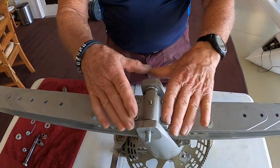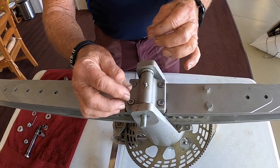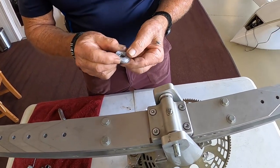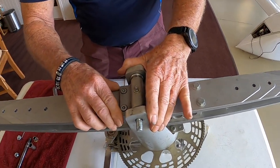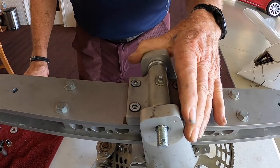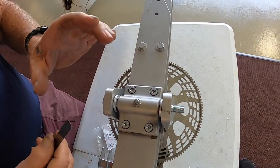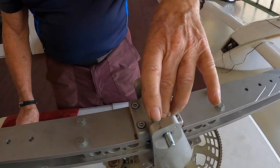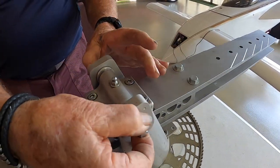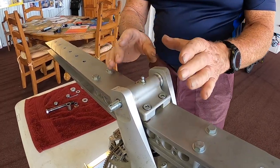Now that we've assembled the hub bar to the teeter tower and chosen a couple of spacers — each spacer should be identical in thickness. When you order them from Autogyro, they come in pairs etched with their thickness. If you've flown for a hundred or two hundred hours and notice slop, use a feeler gauge to figure out how much it has worn, then choose replacement spacers accordingly. You can't over-tighten the nut to deflect the teeter towers inward to take up the slop — that's not recommended. Replace the spacers instead.